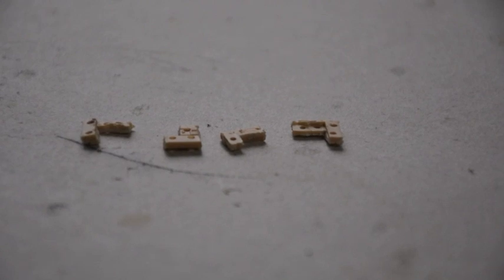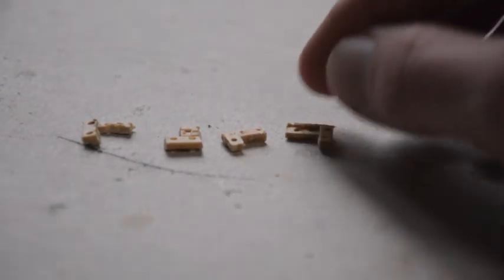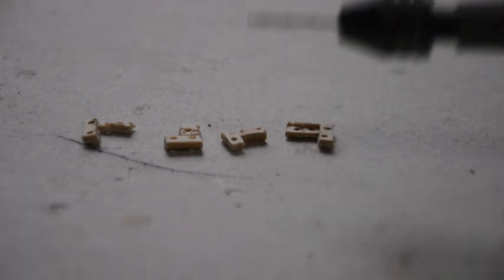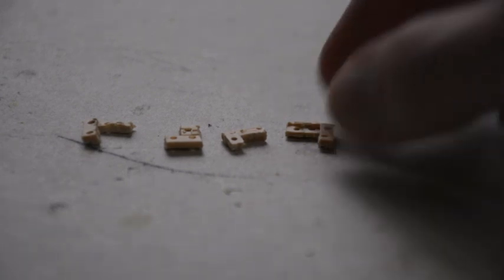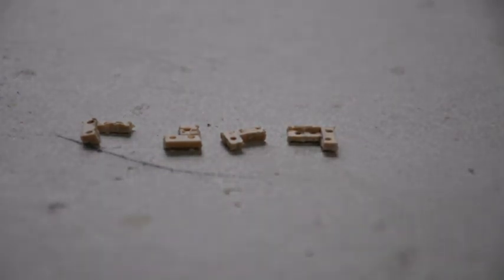So there you can see the 4 cranks that I have made out of that piece of plastic you saw me cutting earlier. And as you can see, if I just tilt this one here for example, you can see there's some light going through there, and that's because I have, with my 2mm drill piece, drilled a 2mm hole through the cranks. And as you can see, on a few of them I have hand drilled a couple of holes, and most of those are for just testing, because the movement of a point rodding system is very fine, so it has to all be adjusted very carefully.